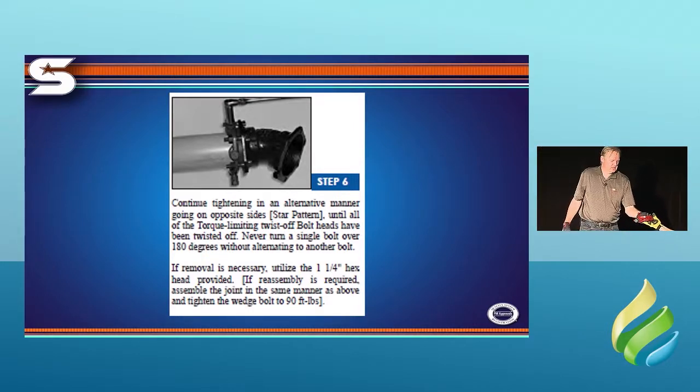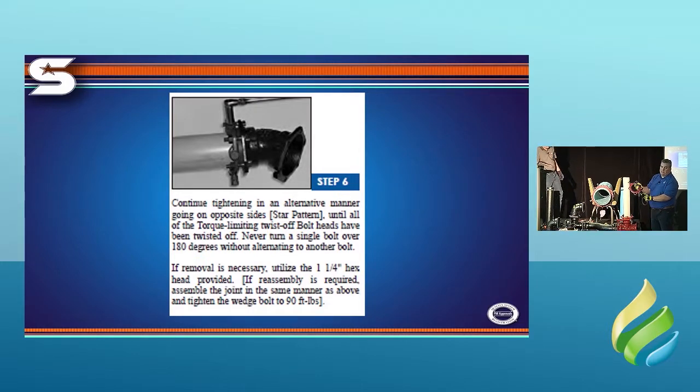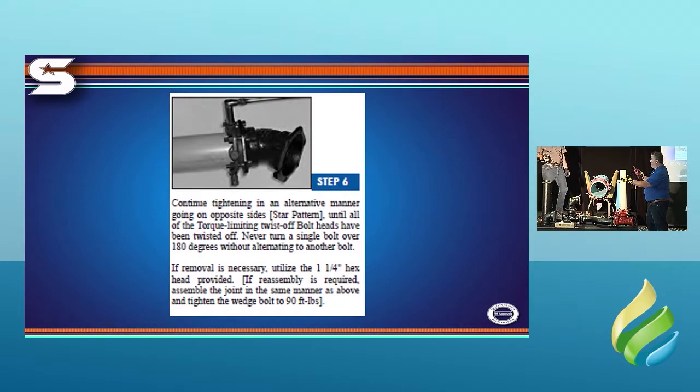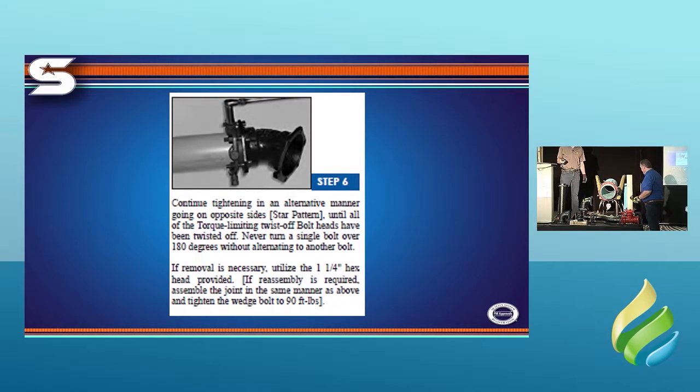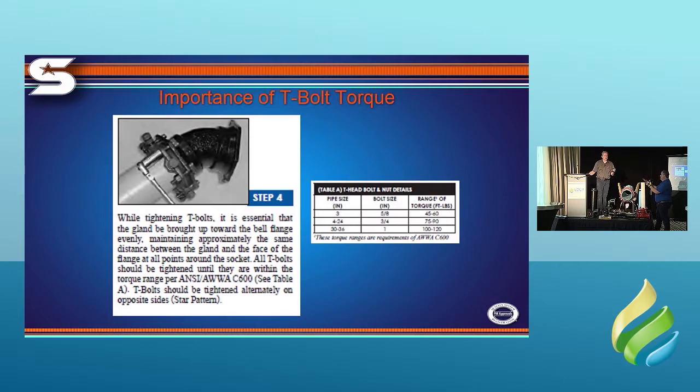This is called our G2 model too. We've got broader wedges for PVC, so you've got less of these to deal with, so it's a quicker, easier install. And I don't know if you're going to go into that or not. No, that's good. Jump the gun. No, that was good. Bolt torque, as I said, bolt torque is crucial. It's written there for a reason.